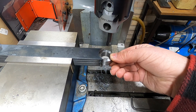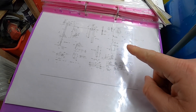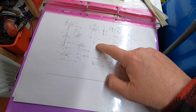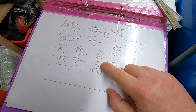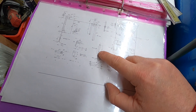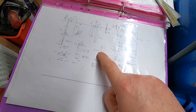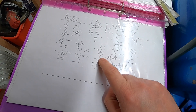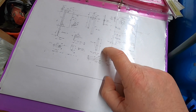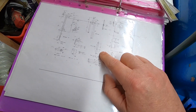That'll do us nicely. So looking at this set of drawings, which are really small — hopefully it's coming out — this is the bit we're making here. This little tiny bit here: that's where we're putting the bosses at the top, and then we've just got to put these two holes in. On this drawing they're three-eighths, so nine mil — we'll put a ten mil hole in. We'll do metric, just to scare you all. We've got the two distances there which we can do with the DRO.